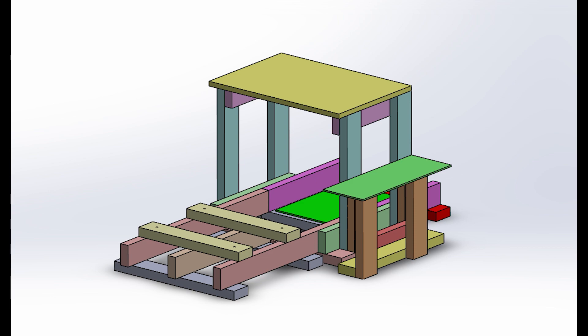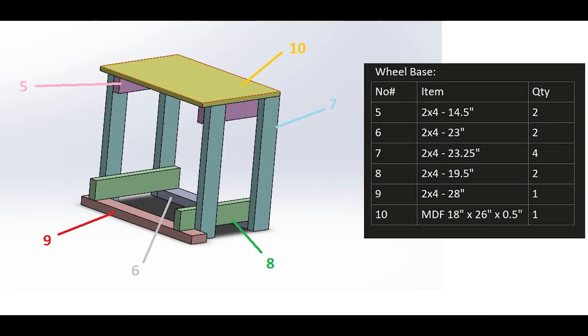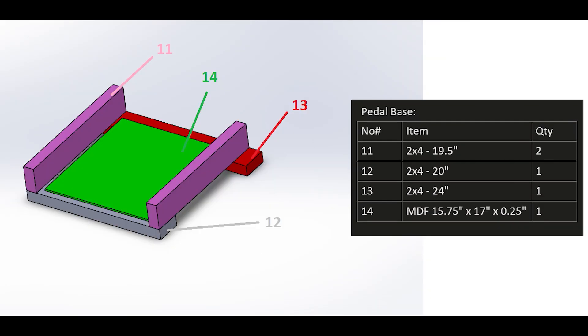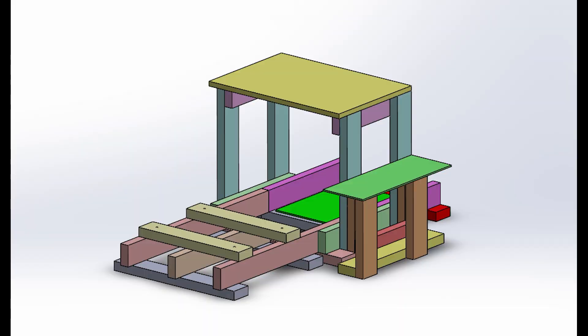This design has 4 sub-assemblies. The first I call the seat base — this is simply the part that holds your chair, and it shouldn't be a problem to mount all types of seats to this kind of design. Next, I have the wheel base, the most complex part of the rig, which serves as the table where your steering wheel will be mounted. Parts of both the seat base and the pedal base will fit inside this sub-assembly. That leads me to the pedal base — I'm sure you can guess what that one is for. And finally, the shifter base sits off to the right of the rig, close to how a center console would appear in a regular car.